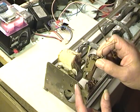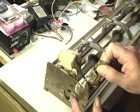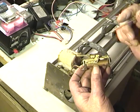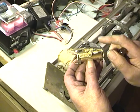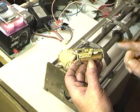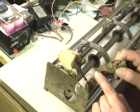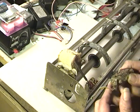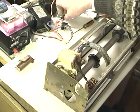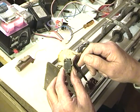This relay is mounted at the back so that this latch runs close to the intermediate wheel. On the intermediate wheel are pins which engage in this latch. With the relay in its non-operated position, the latch is at its highest point; if operated manually, you can see it drops. No current in the relay means that when the motor steps the intermediate wheel round through a pin, it will hold it and prevent further rotation — a mechanism to determine the actual position of the drum. The proposal is to change that to one where a microswitch is operated by a peg on the intermediate wheel, thus determining the position of the drum.